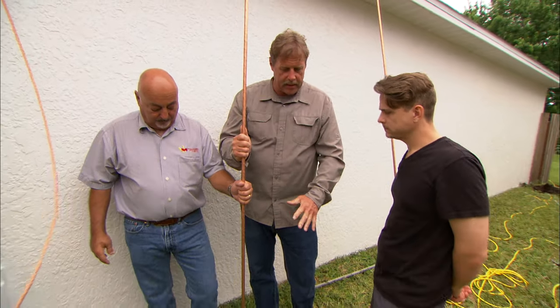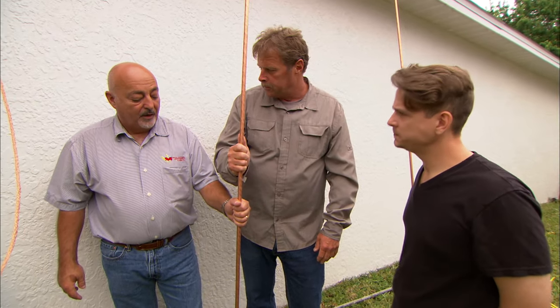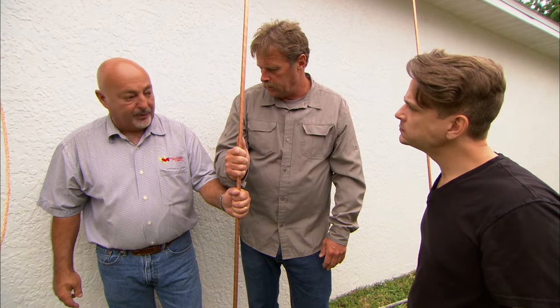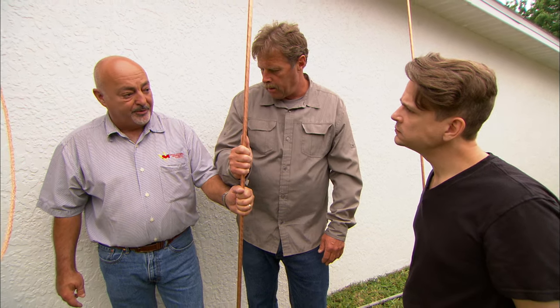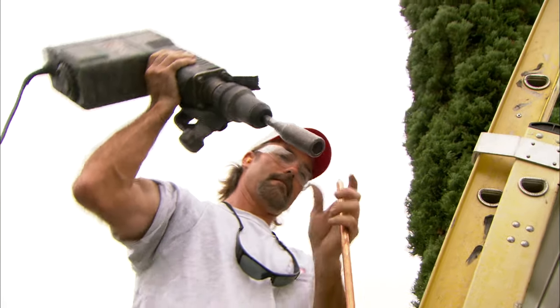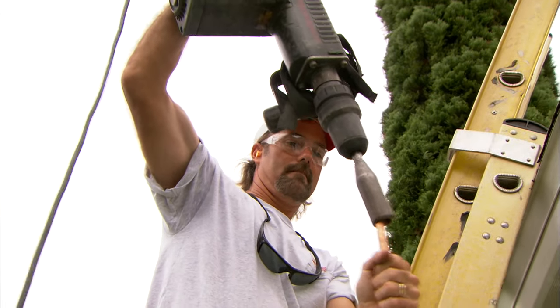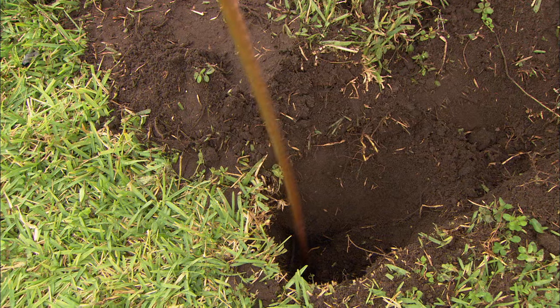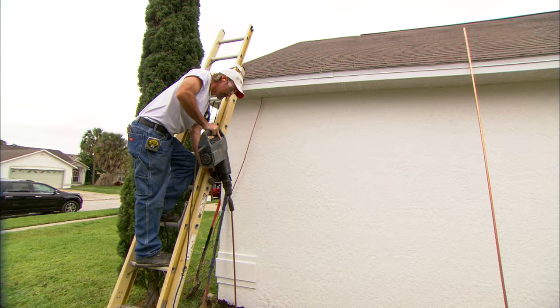I know that this soil is sandy, and that's not a good conductor of electricity. So what do we do about that? Well, normally we would put a ten-foot ground rod in, but because of the soil conditions we're gonna put twenty-foot. We'll couple the two ten-foot rods together and drive them into the ground. A hammer drill in combination with sandy soil makes short work of it.